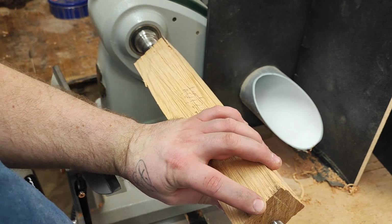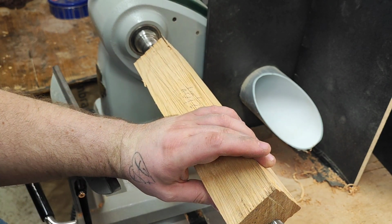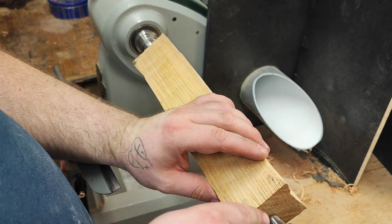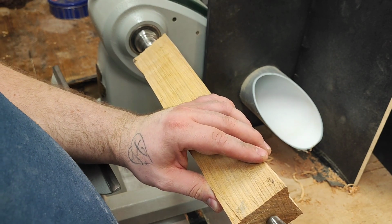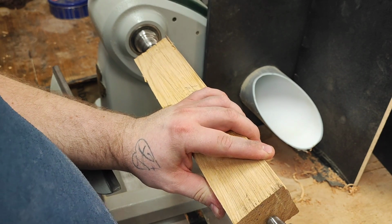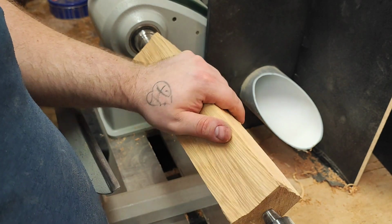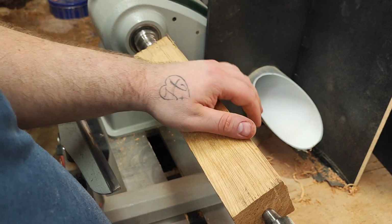Same on this side, so I sight through this side first. Bring the tailstock revolving center closer a bit. Rotate it 90, so I need to adjust it. This way you practice more by eye, so it's not necessary. And if you have something like a table leg, you would like to get crosshairs, since it's much more effective.